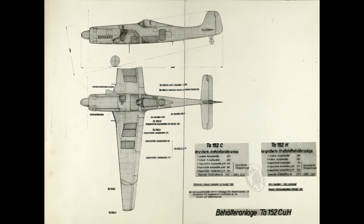However, as the aircraft climbs, eventually even this supercharger system is going to run out of breath, and at that point, the MW50 won't help much because the high levels of manifold pressure needed to really take advantage of it just won't be available. The solution was the GM1, which stands for Goering Mixture 1. I'm not really sure what Hermann Goering's involvement was in this. I guess I'm not 100% sure it's named after Hermann Goering. But in any case, that's what it stands for.